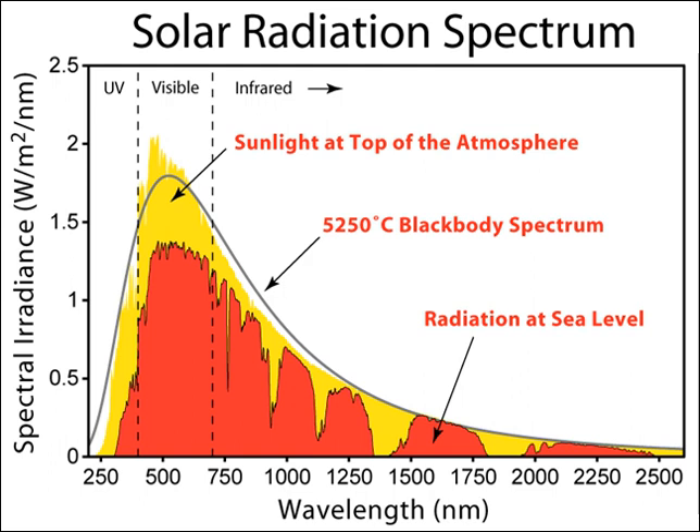One of the major limitations of optical rectennas is the frequency at which they operate. The high frequency of light in the ideal range of wavelengths makes the use of typical Schottky diodes impractical. Although MIM diodes show promising features, more advances are necessary to operate efficiently at higher frequencies. Another disadvantage is that current optical rectennas are produced using electron beam lithography, which is slow and relatively expensive because parallel processing is not possible. However, photolithographic techniques have advanced to where it is possible to have minimum feature sizes on the order of tens of nanometers, making it possible to produce rectennas by means of photolithography.